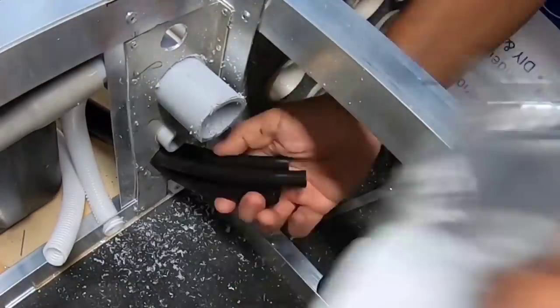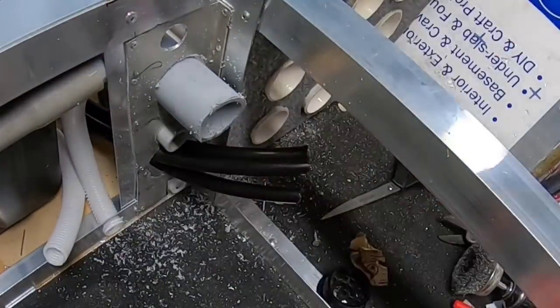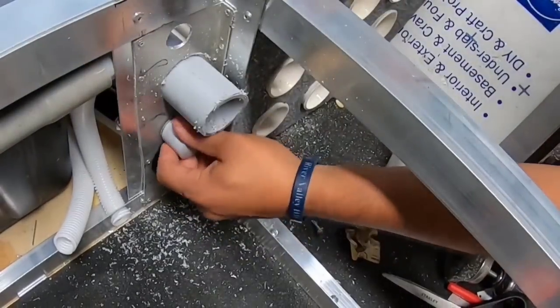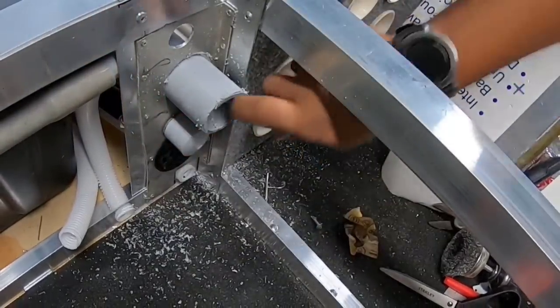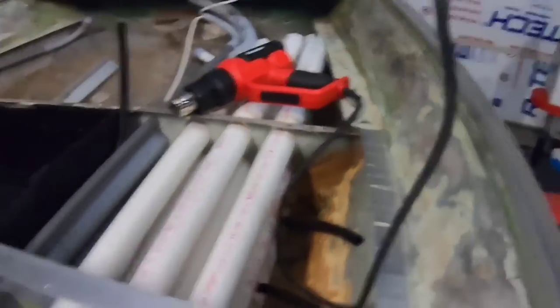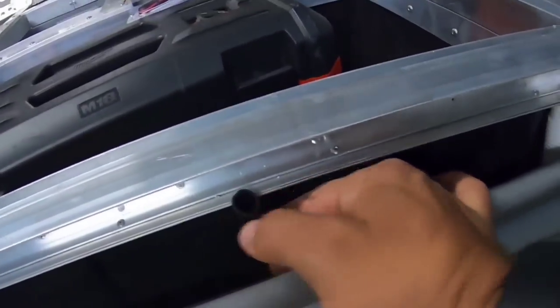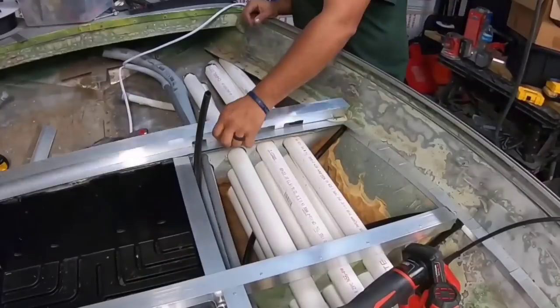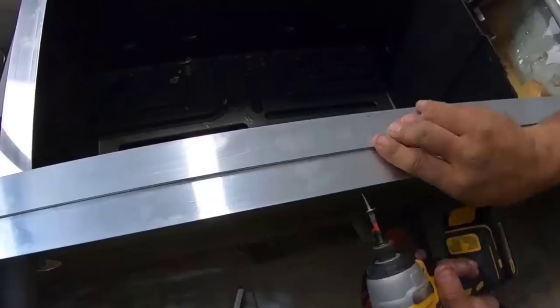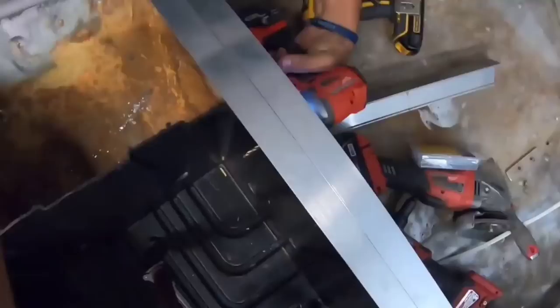That's all black garden hose. I saw in the Lund that the previous boat builders who fabricated the initial build ran it through as conduits, but in this specific application, I'm running it through each corner of the section where I'm going to pour foam as water bleed offs. Because this is not a sealed application, we're going to have to be running bleed offs throughout the foam. That way it lasts. Other than that, I can't find a way to outmaneuver the water, and that will eventually compromise the foam if the water just sits there. So we're going to do everything we can in our power to fix that.